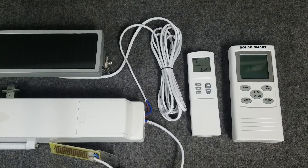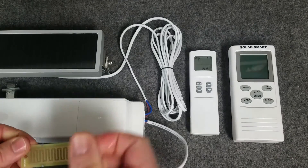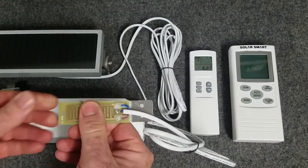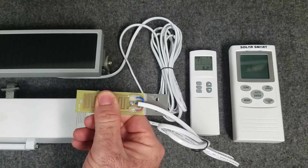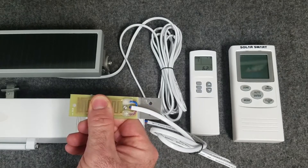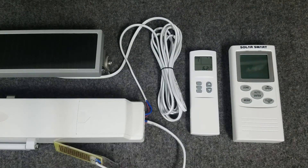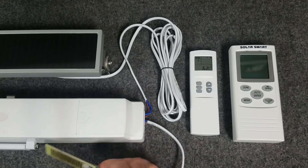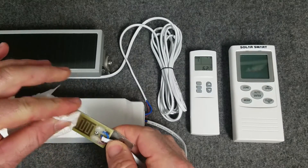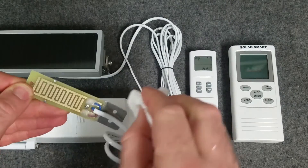With the rain sensor enabled and the umbrella icon solid, we can test the installation of the rain sensor and the setup. We just get our finger a little wet and use your thumb or finger to close the circuit of the two copper contacts, then wait. This can take as much as 10 to 20 seconds. And there we go — the chain now closes. When the rain sensor dries off, the operator will reopen. That process can also take 10 to 20 seconds because it's not constantly monitoring — it's monitoring on an interval.